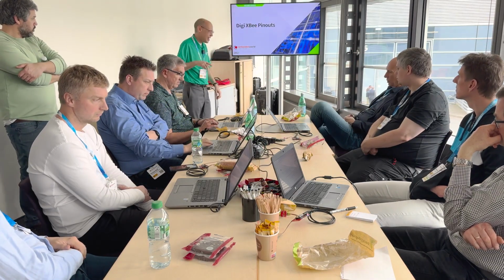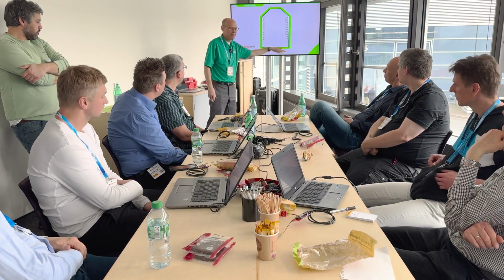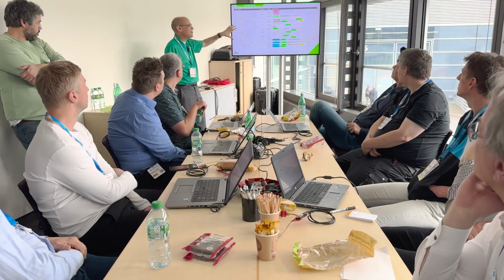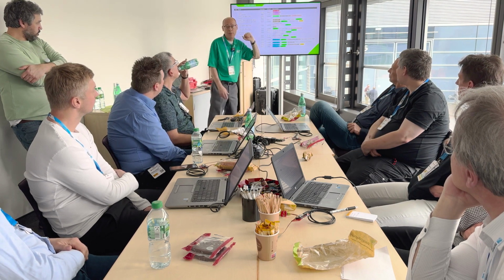Before we end, I mentioned we'd talk about the pinouts. So this is the pin layout, 20 pins, numbered the usual way for embedded stuff. And here's what they're all connected to. So now, you're not going to memorize all of this or anything, but I want to just point out, powering the XBee is very simple. You've just got power and ground, 3.3 volt.